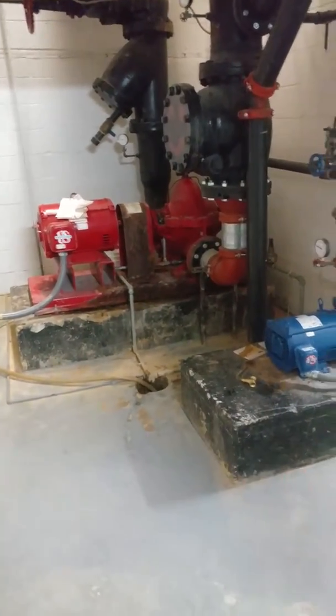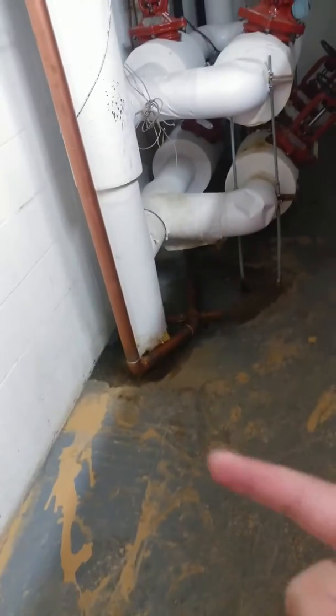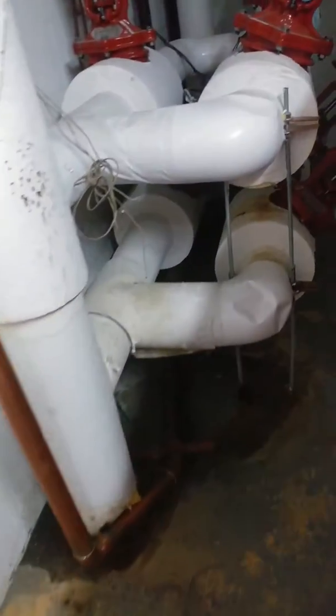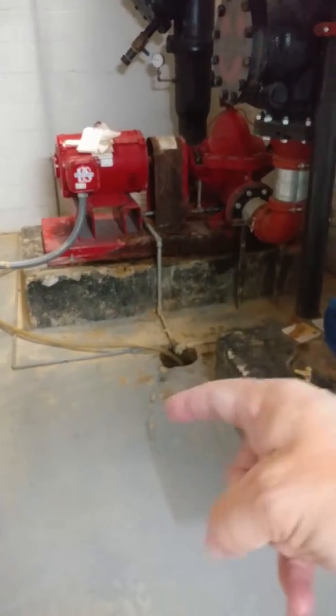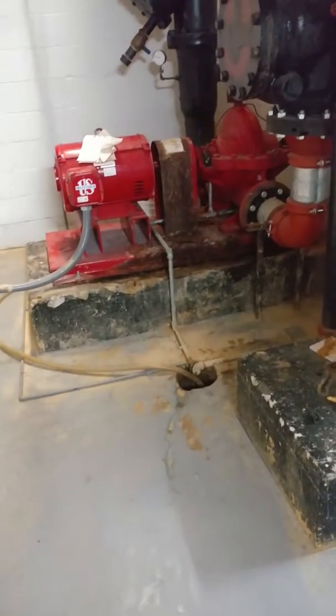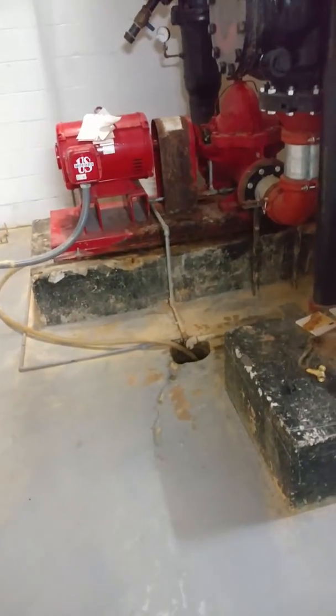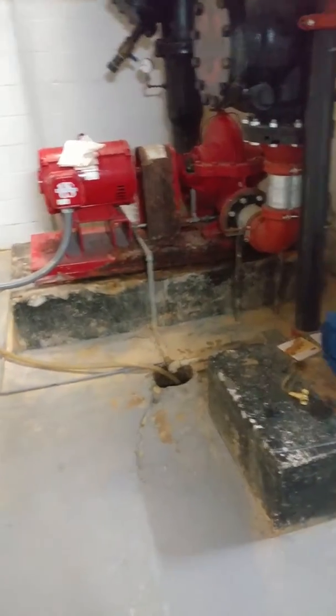I don't know which way the line's running, but mostly it's running over here because there is a drain line coming down here, tying into that huge floor drain. So we're going to have two options to start. We're going to be able to take out the concrete right through here — it's probably 12 inches thick. Jackhammer down, dig down four and a half feet deep, which is going to be interesting. We're going to have to kind of come back this way to be able to get down to it, and try to replace the trap.